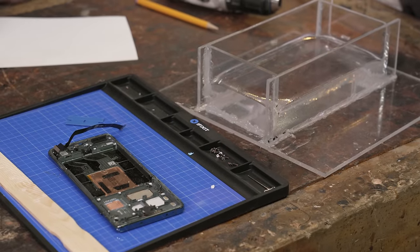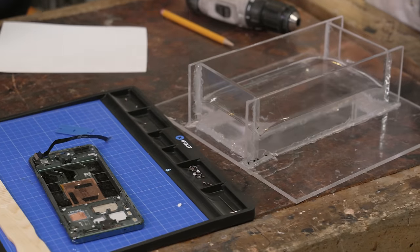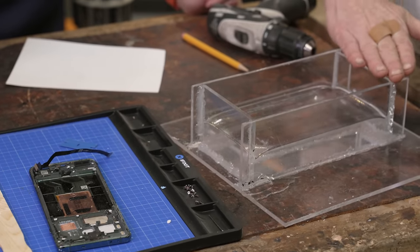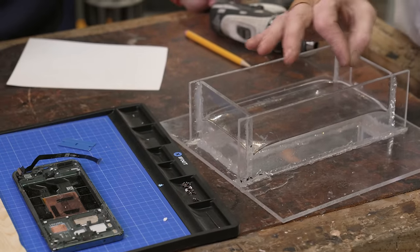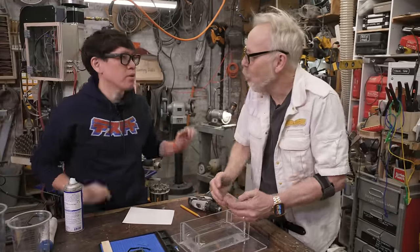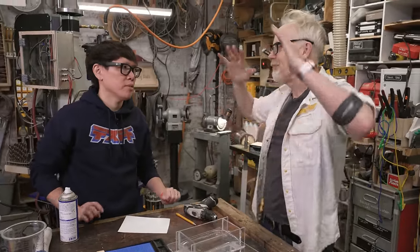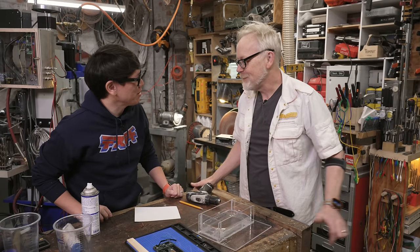My plan is to take some of what we just mixed and degassed. I want to pour in a really thin layer, like 1/8 inch thick, and start putting some screws in and get them positioned where I only have to do it in a little bit of depth, and then pour the rest from like a corner and see if pouring is going to mess up the whole arrangement. That's the experiment. I'm terrified.